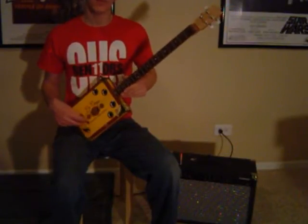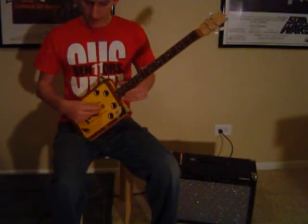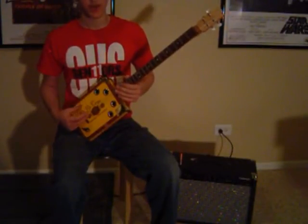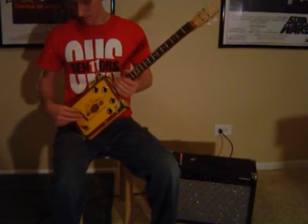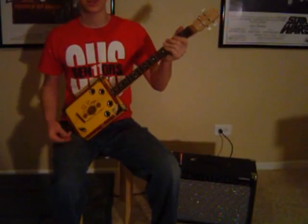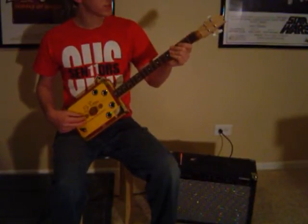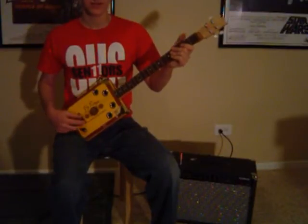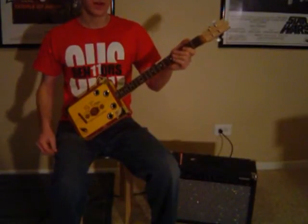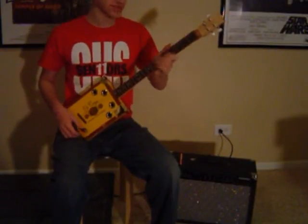For my piezos, I don't put one in — I put two in. I put them right under the bridge, because since the face of the guitar gets its vibration through the bridge, why not place the piezos right there to get the best sound quality — you're going straight to the source of the vibrations. Doing this I've achieved better tone, more sustain, and more volume because it's picking up vibrations more evenly. Using two piezos allows a little more volume and really picks out all the different colors of the tone. One-piezo guitars can sound very good, but you get a lot more clarity out of having two in there.